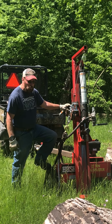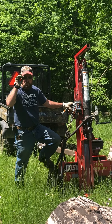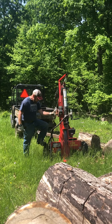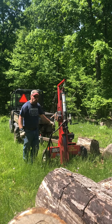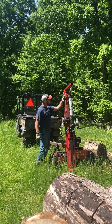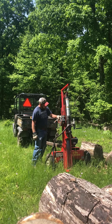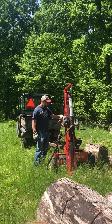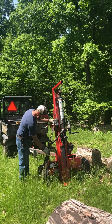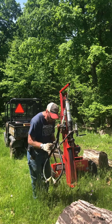What I found was by having to deal with the size of the material that I've got here, it took three guys and it was hard work. Now, thanks to Lane Frieden from Frieden Welding in Elgin, he designed a boom that is welded to my beam on my log splitter, and we fashioned a hand crank winch with the cable that goes out through the pulley system here to my logging tongs.